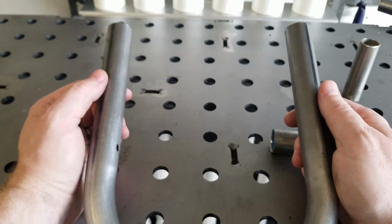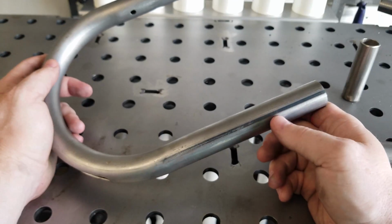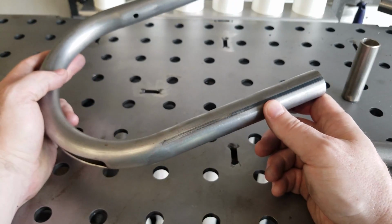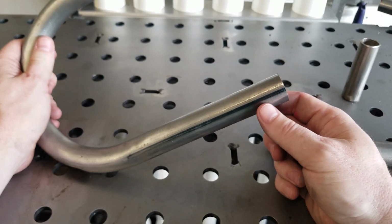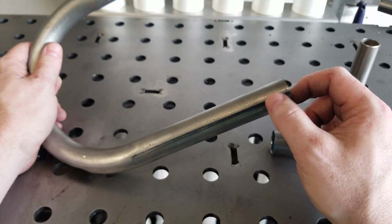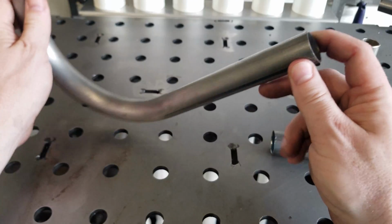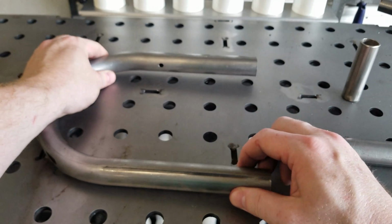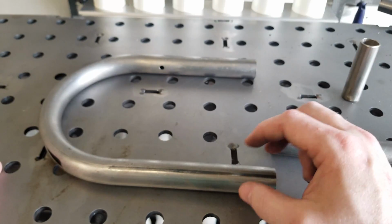In the mild steel tubing world, there are two main ways to essentially build tubing. One, which we have here, is ERW, and that is electric resistance welded. So what they'll do is they'll take essentially a sheet and they will roll it over, and then it gets welded together. So it has a seam, and there's a very slight flat spot where that seam is. But of course, as you're welding it, your base material comes through the back, and you get this little ridge in here. The other tubing that you could go with, which would avoid that altogether, is called DOM, or drawn over mandrel.